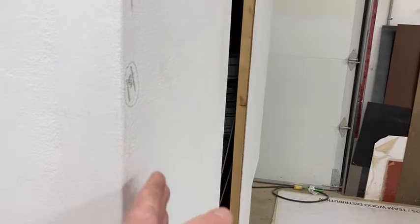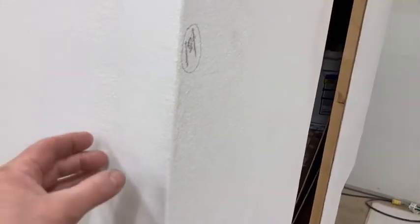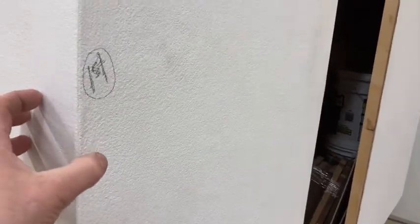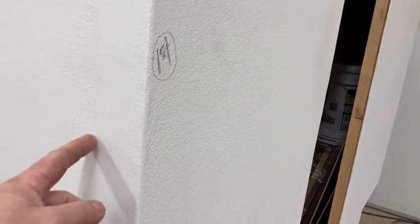So when I'm building my corner assemblies, I'm gonna have to put the backs and fronts on first or have them be proud. I'll show you how they're going together. Because I need the whole width of this molding to cover this seam. If I overlap the sides from the back, it would actually sit a little bit inside the seam and it's gonna look pretty crappy, I think.